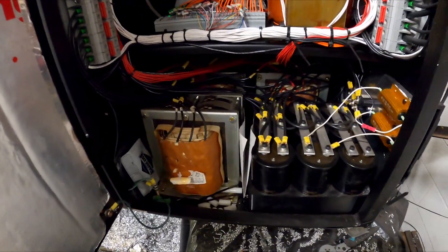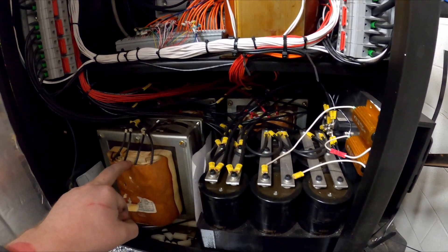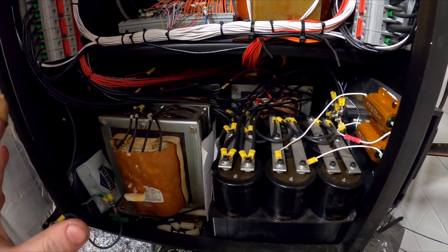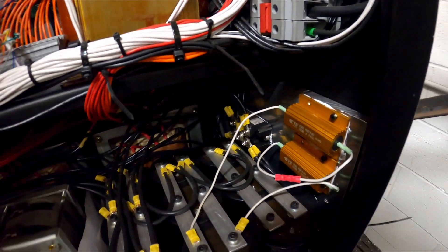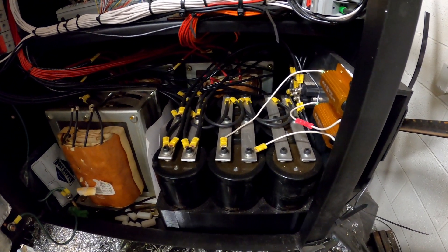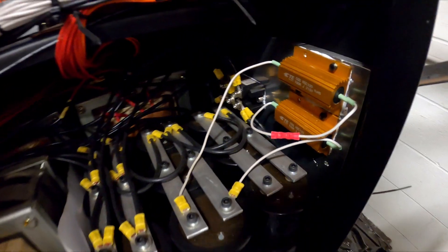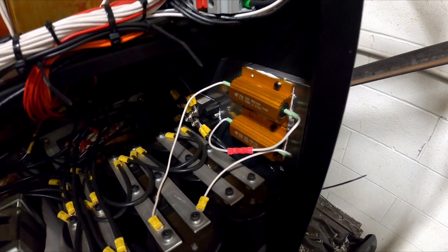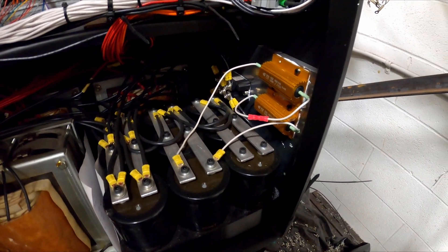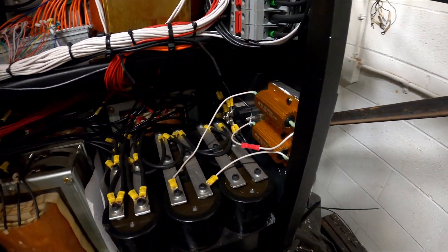I kept with the DC servos. I got these transformers that step 208 down to about 90 volt, then it goes through a bridge rectifier which then gets it to about 130 to 140 volt DC to these big capacitors. There are some bleed resistors, so when you power it off these drain in less than a minute because they used quite big resistors.